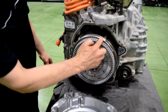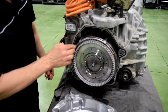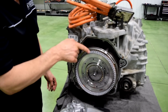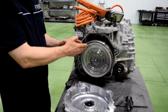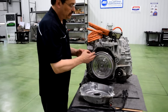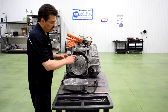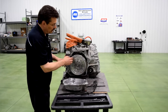And then if we move in here, you can see this ring right here. This is actually an oil ring — what we do is inject oil out of this ring, so oil comes into this ring and we actually squirt oil onto the end turns. What that does is keep the end turns very cool. In a normal motor, the end turns run somewhere between 20 and 30 degrees C hotter than the windings inside the slots of the stator. So by squirting oil onto the end turns, we actually keep it cooler, and that reduces failure modes.